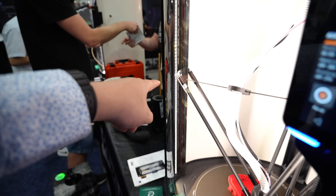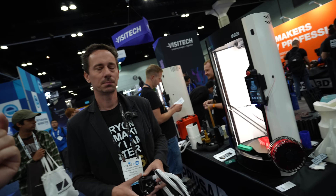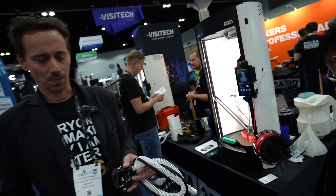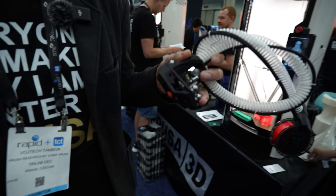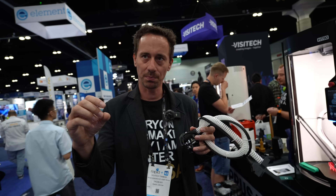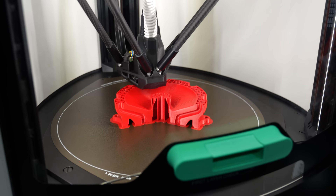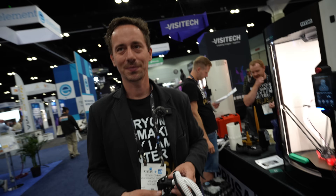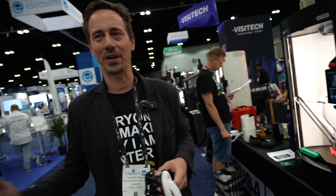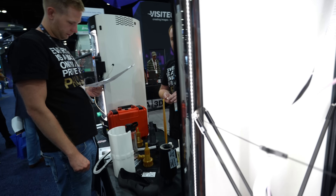On the magnetic ball joints: a traditional design uses rod end bearings with a spring to take up slop, which produces wear. These are made in-house — the spheres are hardened, used normally in ball bearings, and are welded to a machined part so we can mount them to the printhead. We use really strong magnets, because lower-grade magnets will lose their properties at high temperatures. That's why they're custom-made using the highest grade magnets. There's also a special grease — a little secret sauce — used with the design.